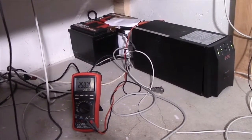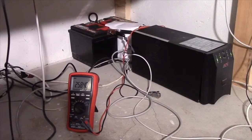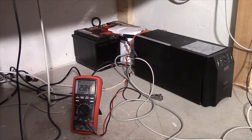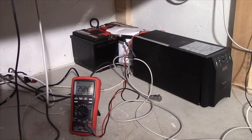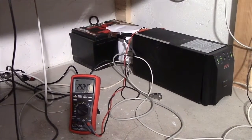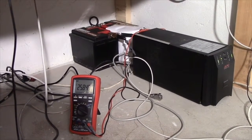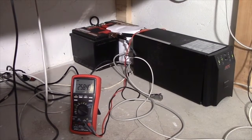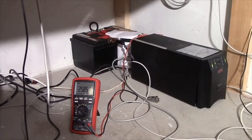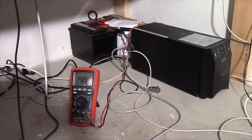So I'm quite happy with it. It's about a bit more than twice as long as the 15Ah batteries run. So if we do a really crude math, these are equivalent to maybe 35Ah batteries. But I'd wager these batteries aren't as good as those AGM batteries at supplying current for a long time. Yeah, they're not in too bad shape. They could probably have been better cared for — I made a mistake by the way I set it up. But this is going to translate to maybe an hour of run time with my normal setup, so that's alright.